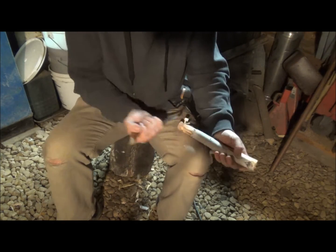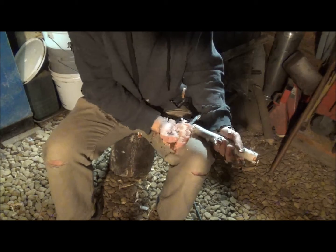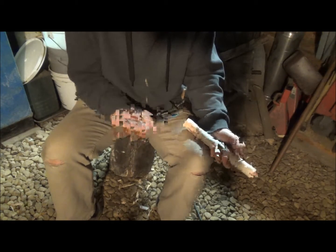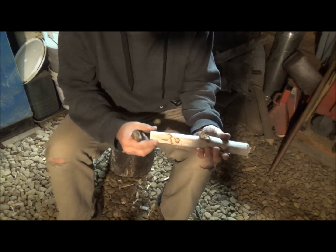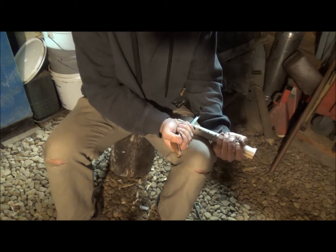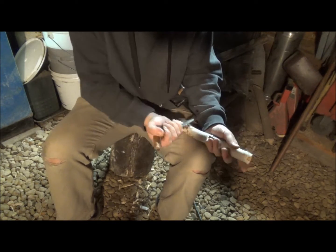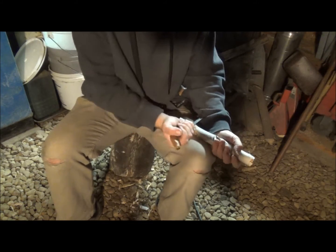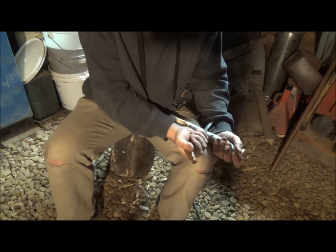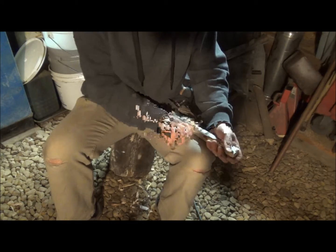Except for the knot. That might actually be hatchet work there. What I'm going to do is I'm going to taper this end, and then I'm going to cut it here and here, and then taper the other 2 ends, and that'll be a rough shape of where I want. And then I'll fit the brass caps for the ends. I want to get a rough dimension on how big around I want it to. And we're making it straight at the same time.